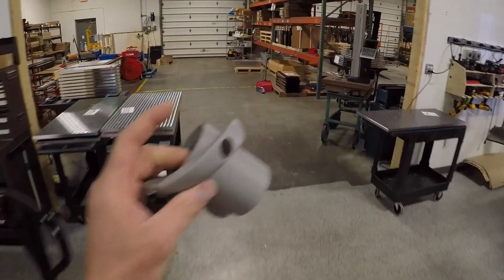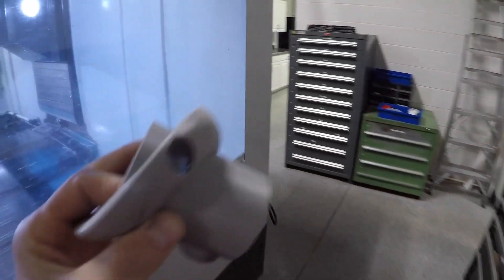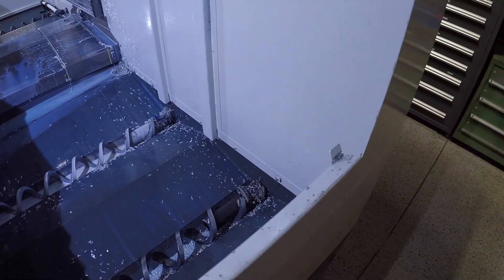We also tried some augers — I'm holding one right now. This is super fun and it looks cool, but it's actually not going to be the right design. You can see we've got two of them in here, helping to prevent that build up at the very end of your chip augers. The trick is going to be instead to just print a bridge that goes over it and probably a solid spacer as well. Rather than trying to evacuate the chips, we're just going to try to stop them from ever getting there.